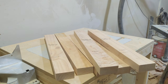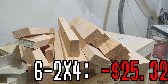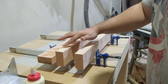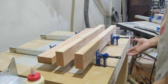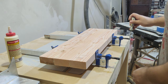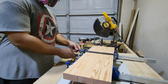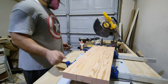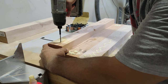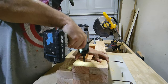I went ahead and cut the two by fours down into 18 pieces and 12 off cuts to act as filler. Almost forgot to say — I squared up the two by fours on the table saw to make the glue up a little easier, or so I thought — more on that later. A little glue, the finger brush method, then wiping off the excess glue on the workbench just like God intended. The middle row doesn't have to be a full length board to save on some two by fours.